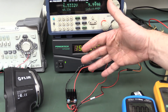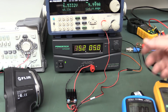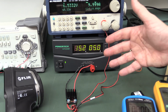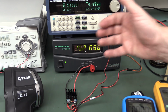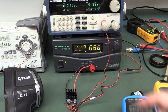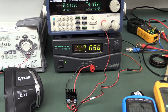If you just looked at the datasheet value, then you would think, no, this design is not viable. They haven't left adequate margin. But when you actually do some tests on this, granted they're not massively controlled tests, but they're going to give you decent back of the envelope performance figures, then this thing is actually a pretty reasonable design at the higher input voltages.